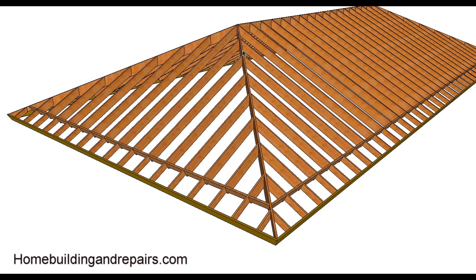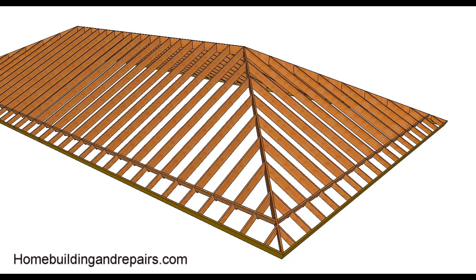The older homes that we used to work on when I first got started would have a single hip — like a two-by-ten if the rafters were two-by-eights — and that was fine, but they sag under too much weight. If you can brace them, fine. You'll see even looking at this house that there are a couple of walls where you could put a brace underneath the hip to a wall, but over here there might be a garage, and on the other side a large room — so it's not always going to work out. That's why they require larger materials for the hip.